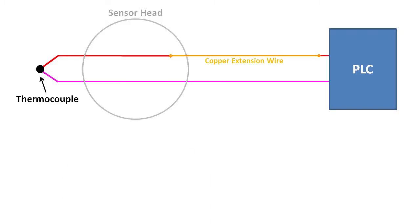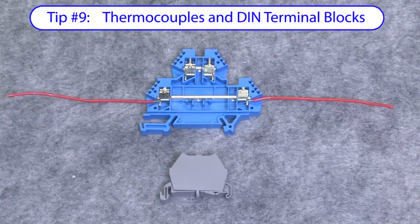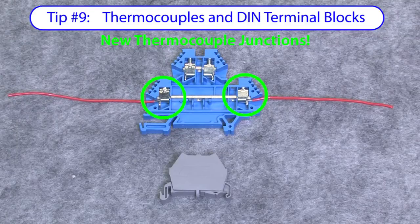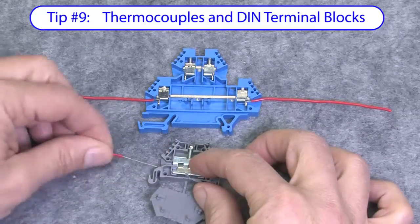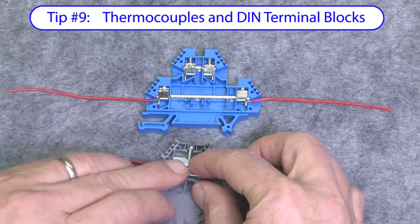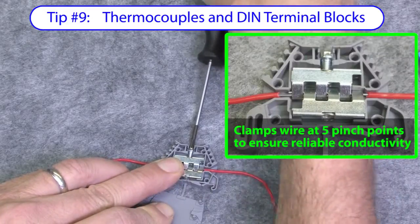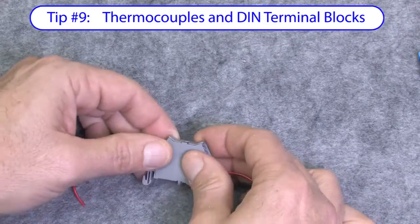Could you use this trick with a long piece of copper wire? No, because the two junctions will most likely be at different temperatures and they won't cancel each other out. A normal DIN rail terminal block connects wires via a metal bar. You don't want to do that with thermocouples because it creates a new thermocouple junction. Instead, use these special DIN rail thermocouple terminal blocks. They actually clamp the thermocouple wires together so you maintain the metal continuity without creating a thermocouple junction. They are inexpensive and an excellent way to maintain the integrity of your temperature measuring system.